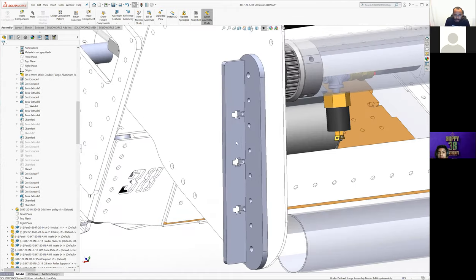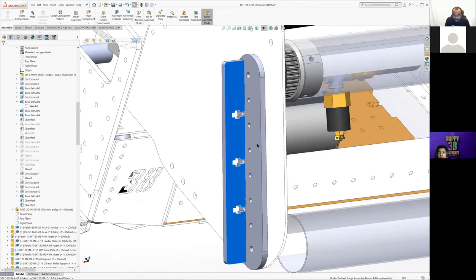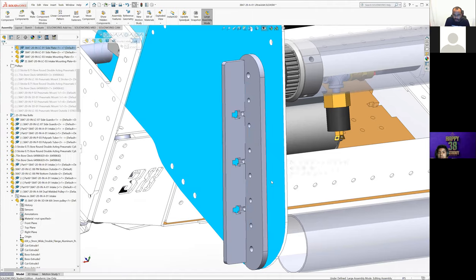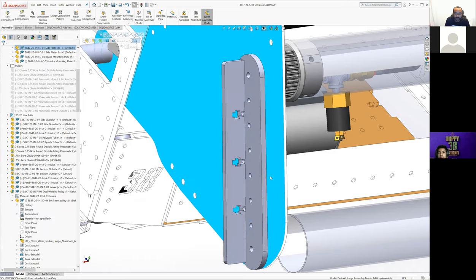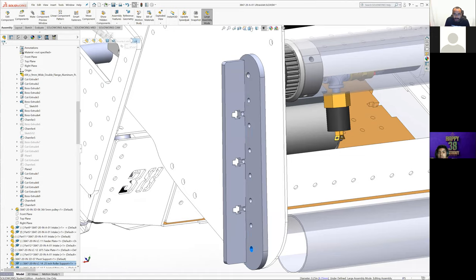So it's very possible we could have done just this plate into here, which is something we may have tried if we needed the weight back, right? We could have had a little T-slot and just bolted this straight to here. But it made sense because we want to make sure we're getting these bolt holes exactly and making sure none of that bends in some other way, so we have this for now.